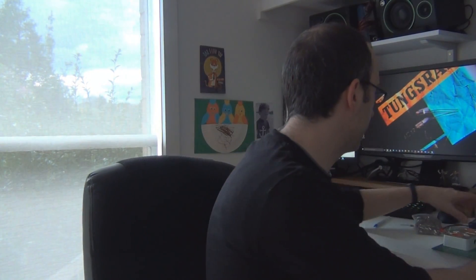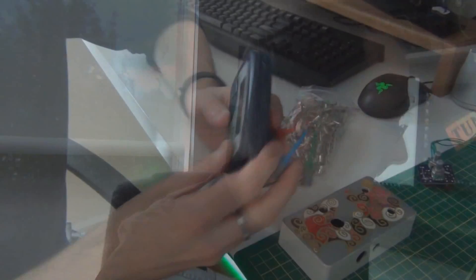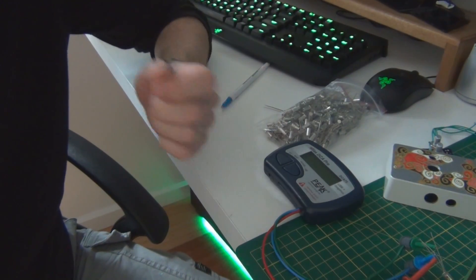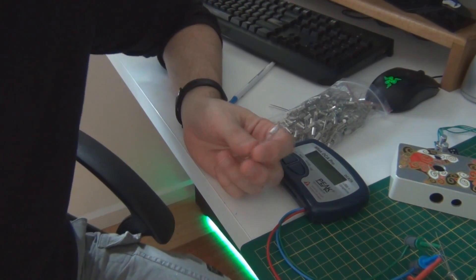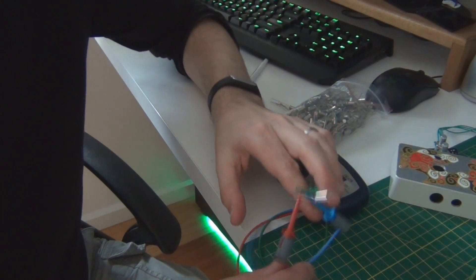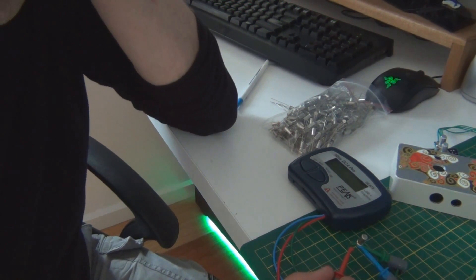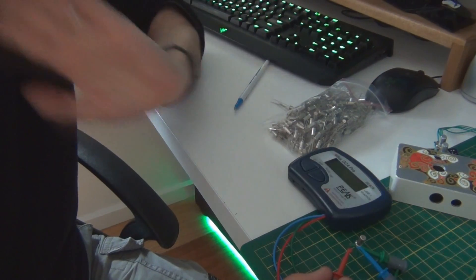Let's have a listen shortly. I've got a normal pedal - actually an MN42B - interesting. Before we do the sound demo, let's get the DCA and measure the gains. These transistors are SFT307s. Before you run off buying a bunch of SFT307s, let me tell you - these are measuring not normal. I've got other SFT307s which measure all over the place from 50-60 up to 180 hFE, which is why I bought them, but these ones for some bizarre reason are very low.